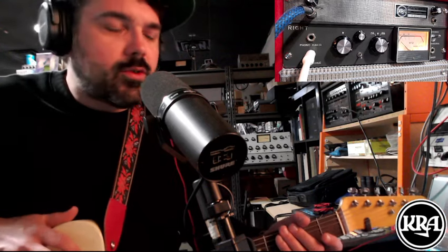I've come up with some modifications on the old designs here that I called the SOS. We got cascading and other options for the 2 channels. This is a total departure, and the only parts of the original Akai that I kept, of course, was the power supply stuff. All new caps. I kept some of the plate resistors. It has those cool wire wound 250 ohm plate resistors, so those stayed in. I like to think that contributes a little bit to the sound. But everything else is new build, it's new design, it's new layout.